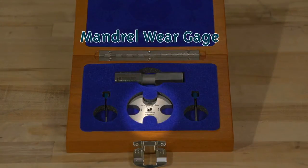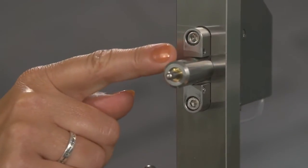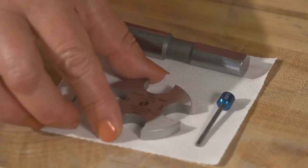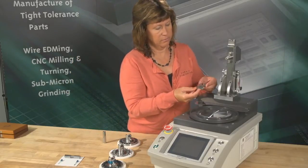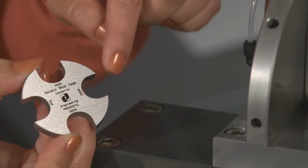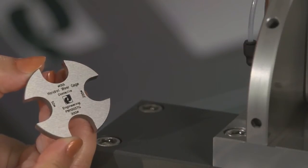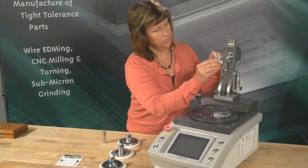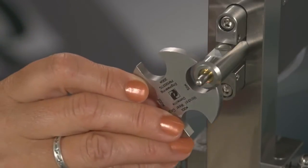Step 2: The Mandrel Wear Gauge. The mandrel wear gauge measures the machine mandrel outer diameter worn due to natural deterioration that occurs when the fixture is mounted repeatedly over time. The mandrel wear gauge has four measuring slots: 50%, 100%, 200%, and 300%. These represent OEM specifications. Begin at the 50% setting and check multiple locations around the mandrel, as it most likely will not wear evenly.